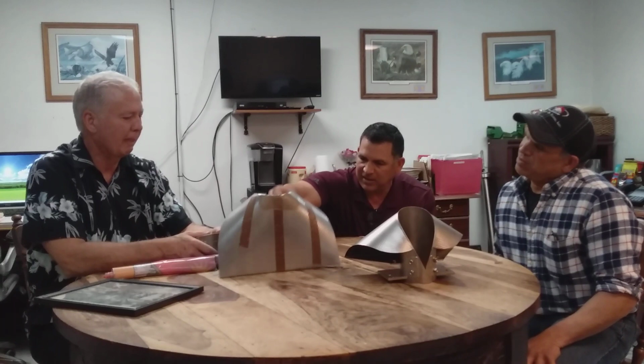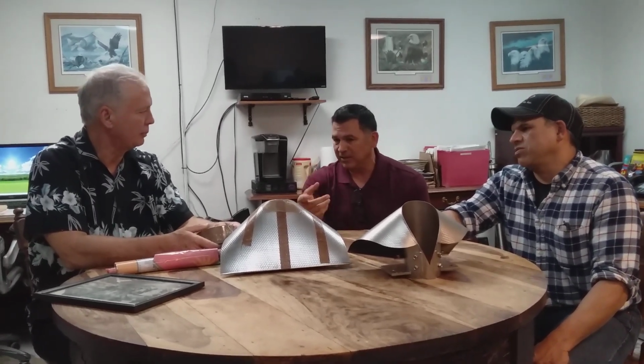This is for a rice company. They package a lot of rice, so there's a lot of dust particles in there. As you can see in the collar, you see a lot of white dust in there. So if that gets in between the film and the collar itself, it's like sandpaper. So your wear is going to be quite drastic over time. It'd be quick. In 6 months, you can look like that.